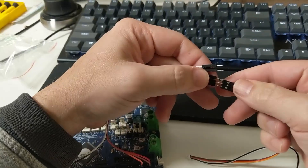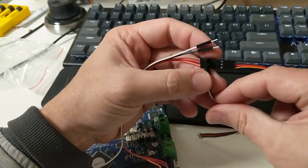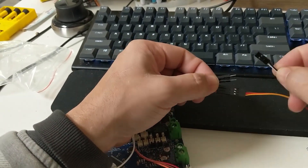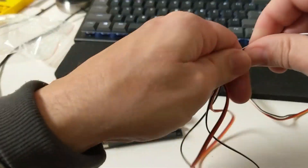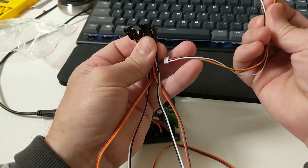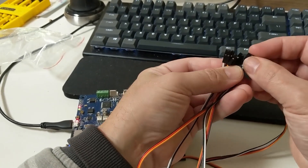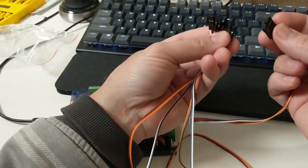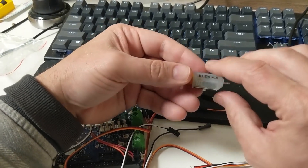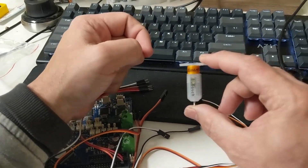The final thing to talk about is the wiring. I've got these male pins plugging into the female ends on the connector that plugs into the sensor. The extended wiring that came in the box has female ends on both sides — so how are you supposed to plug this into the shorter loom here? You have three female connectors — that's a problem. Also, you can tell the genuine BL Touch from the clones by the name — this one says 'BL Touch' whereas that one says '3D Touch.' And on the PCBs, you will see a QR code on the genuine one — that's the high quality one that you know will work.